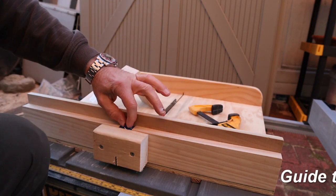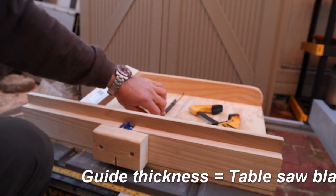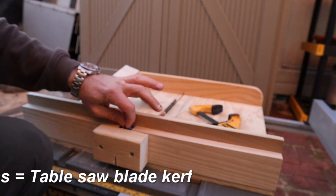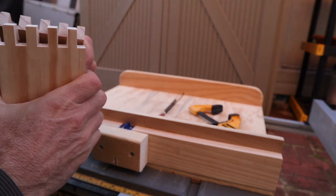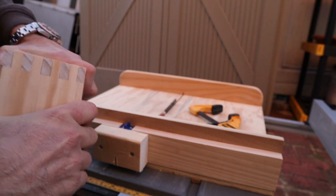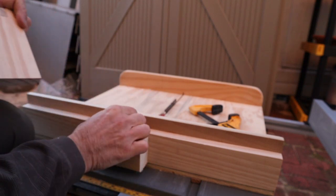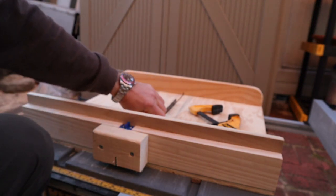The thickness of this pin has to be equal to the thickness of the cutting blade. If the thickness is different, it will be either too tight or too loose. In order for it to fit correctly, the thickness of the pin has to be exactly equal to the thickness of the cutting blade.